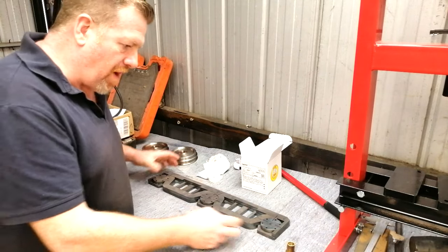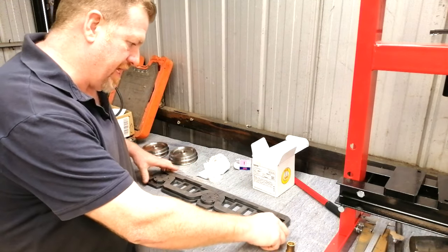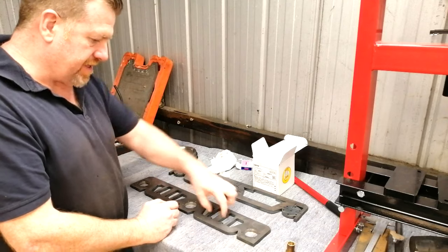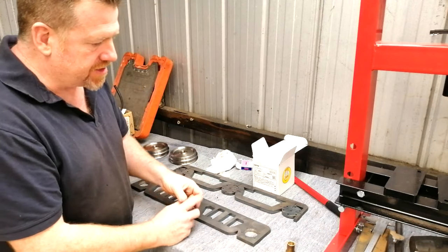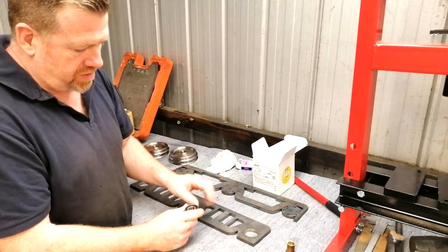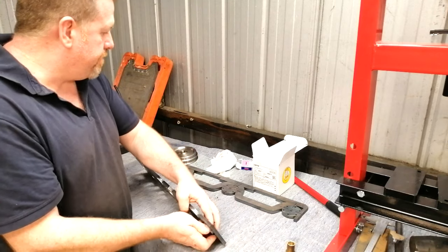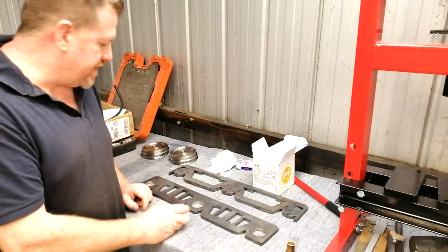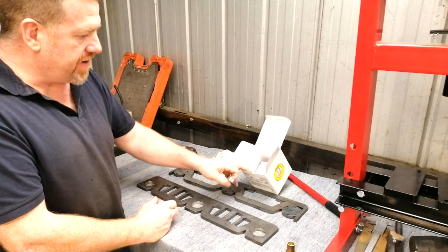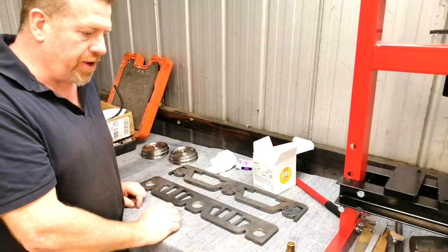So this is roughly an outline of the bogie. It's prototypically correct, but it's not 100%, but it will do. Essentially what's going to happen is the springs will be put in this position here, but what I'm concerned about is my bearings. So they're the bearing caps, and each one of these will pop out, and then they're bolted through the side frames. But then I have to press the bearings in here to hold the axles in place. So that is the next thing to do, is we'll put a little bit of Loctite on these and press all 12 of these bearings into the bogie side frames, and then we can start assembling our bogies and seeing what they look like.